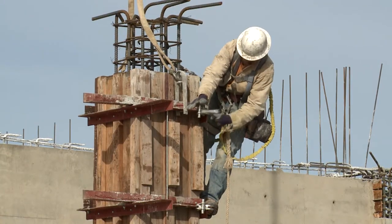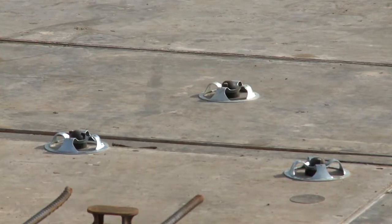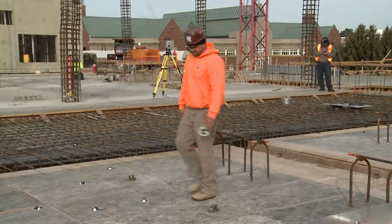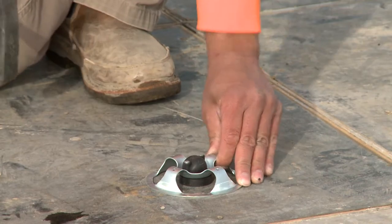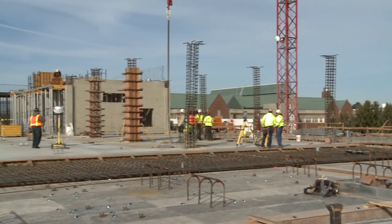Because it's all concrete, we're using the spider application. We set the spider on plywood and then they pour the concrete decking over that, and below there we have a cable. Myself and one other guy walks around — he has a stick which tells me exactly where the grip is going to go. That locates the spot, and then I have the Gripple Spider and I put it on the spot, nail it in, and it's done. We walk away and go to the next one.